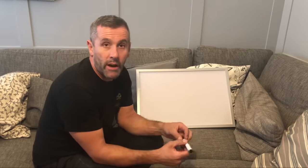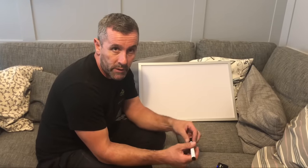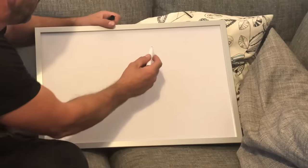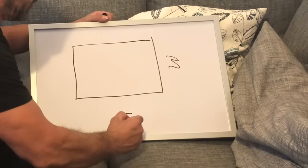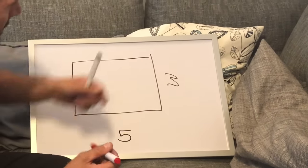In this video I'm going to show you how we put a roof on a building. Today's building is five meters by three meters. If you're more than three meters wide we'll double up the joists because the roof span is too big for 5x2 timber. Basically, here are your walls looking from above — it's three meters deep and five meters wide.